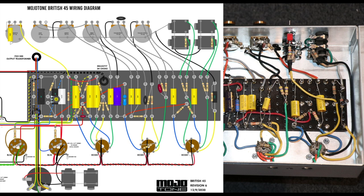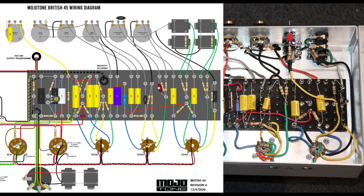Your guitar signal will be amplified via V2B, it'll make its way through this coupling cap. DC on this side, no DC on this side. And then we've got a 470K voltage divider, right? So from here you connect straight across, got to bridge those, okay? And then 470K here. So in the stock JTM45, you can see I've got 270K resistors here, 270K, 270K, and a 250 picofarad bypass. You rip all that out, put two 470Ks in here.